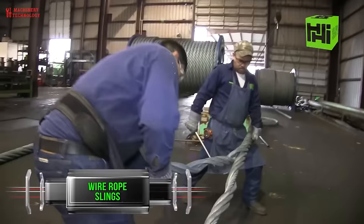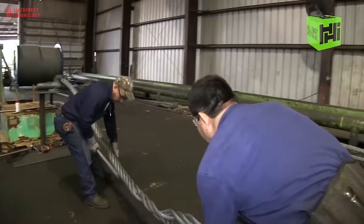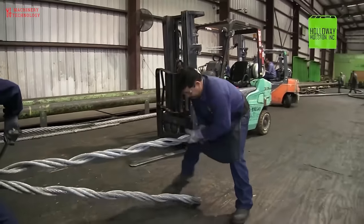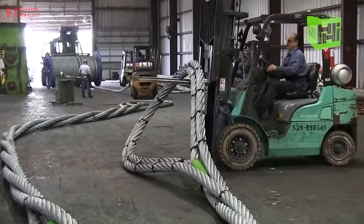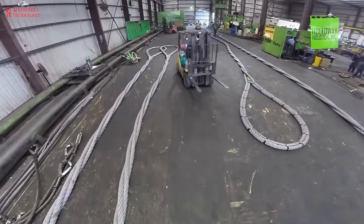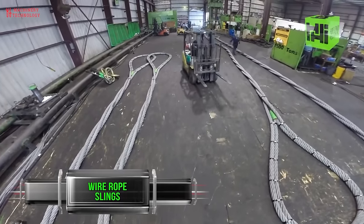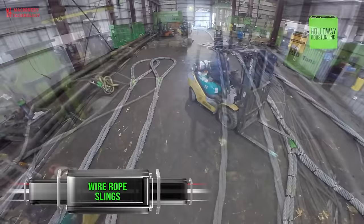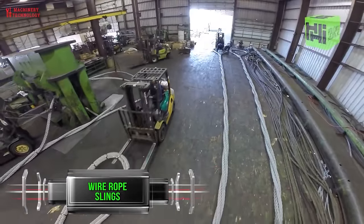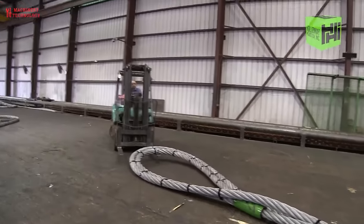A Flemish eye, or Dutch splice, involves unwrapping three strands. The strands need to be next to each other, not alternates, of the wire, and keeping them off to one side. The remaining strands are bent around until the end of the wire meets the V where the unwrapping finished, to form the eye. The strands kept to one side are now rewrapped by wrapping from the end of the wire back to the V of the eye. These strands are effectively rewrapped along the wire in the opposite direction to their original lay. When this type of rope splice is used specifically on wire rope, it is called a Molly Hogan, and by some, a Dutch eye instead of a Flemish eye.